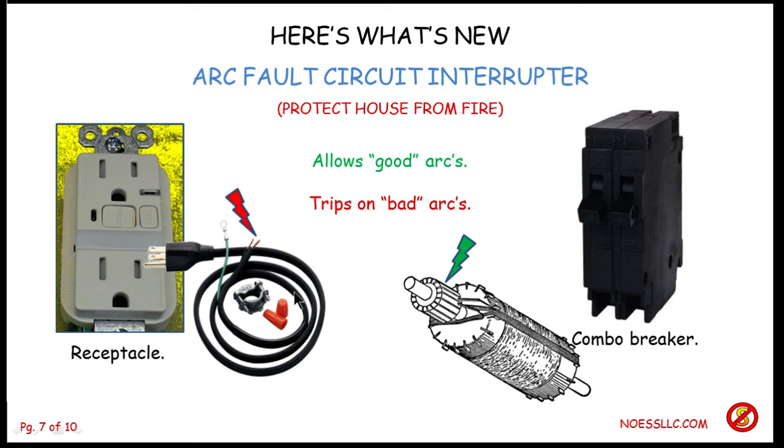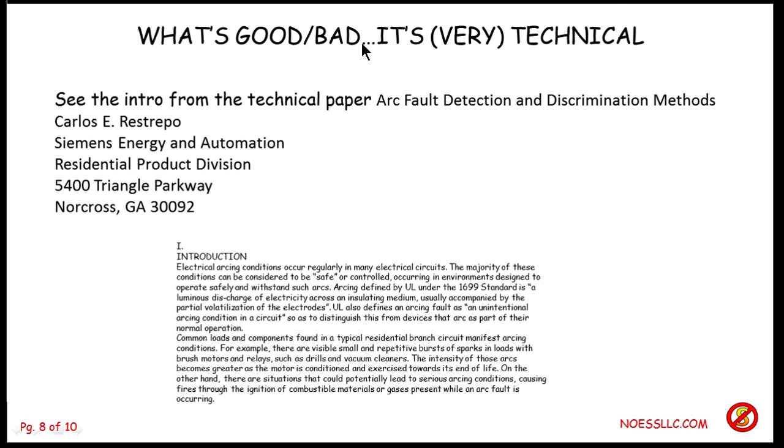That can create an arc — and that's a bad arc because the cord will heat up and eventually can create a fire. Or how about the wiring inside your wall? Maybe a mouse is running around and likes the insulation, so it starts eating the insulation until finally the two wires inside that sheath can start conducting — once again heating up, vaporizing the rubber and plastic insulation, and causing a fire. So arc fault circuit interrupters detect bad arcs and open up the circuit. They also come in two different forms. So the key is determining good arcs from bad arcs — and that's a really technical thing.